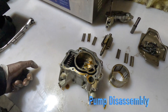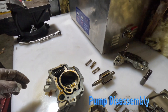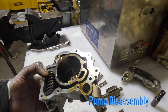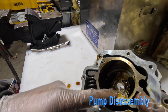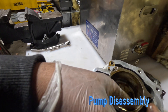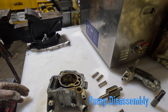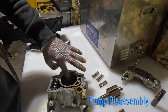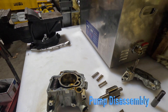We've got everything disassembled, so we'll go ahead and clean and inspect everything. What I'm not going to do — unlike other pumps — is take these two springs off, because they look like pretty beefy springs and I'm not going to attempt that. I can do my inspection from here: inspect the lower housing for scoring, inspect the ID of the impeller for scoring, and then put everything back together. I'll do some light sanding to remove any high spots if there's scoring.